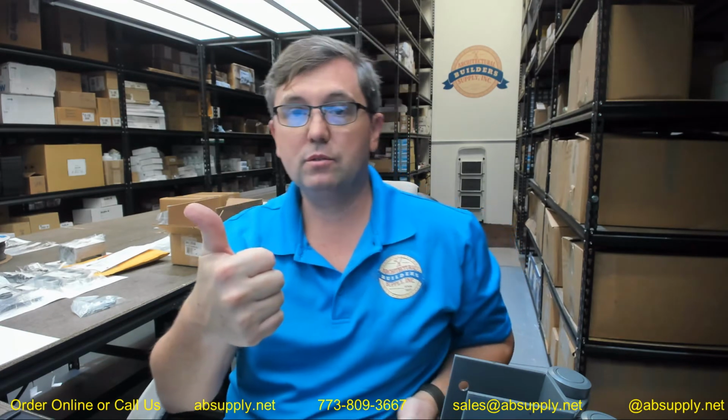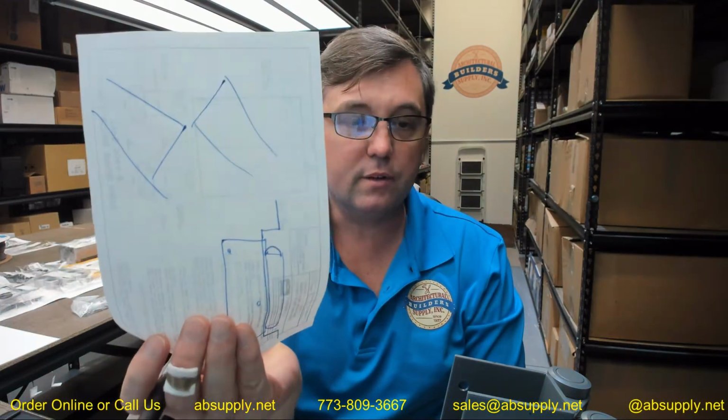Now it all changes if you're doing a pair of doors. It doesn't really change, you're just doubling it basically. Double door: 1/8 of an inch, plus you're moving from hinge to door to gap to door to hinge. 1/8 of an inch plus your door size, plus clearance B, plus the net door width, plus the 1/8 of an inch. That's 2 clearance B's. You've got to make sure that these doors, when the hinges are in there, are not going to hit each other. You're going to have those 2 hard outside corners that could come and hit each other.